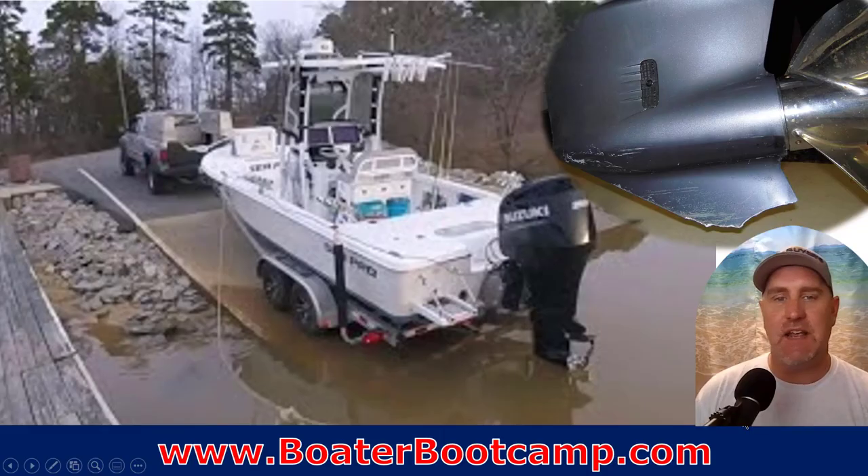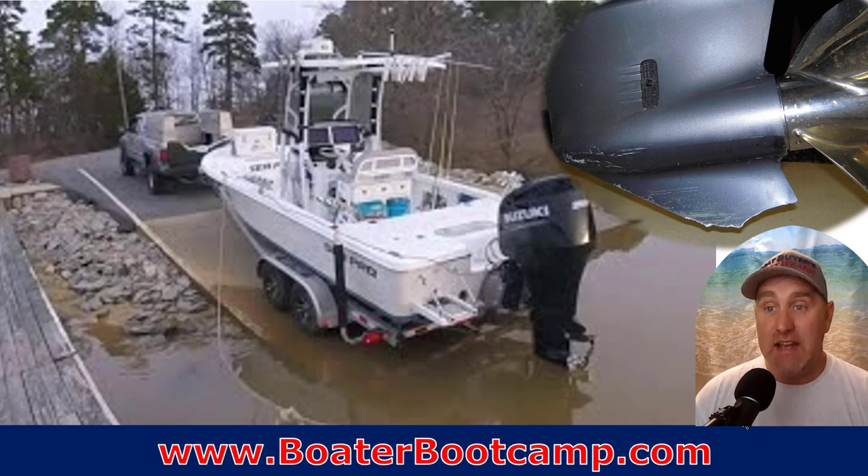The first mistake you'll often see at the boat ramp is forgetting to raise up your lower unit before you pull out. You get it all loaded up, get it on the trailer, get it tightened up on the winch strap, and forget that little step of pulling your drive up — lifting that drive up on your stern drive or outboard. It can drag on the concrete, which can damage your gear casing where all the gear oil sits, or break off the skeg. Always remember to trim up that lower unit and put it in the trailer position when you're pulling out.